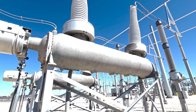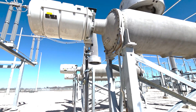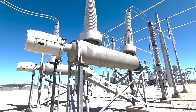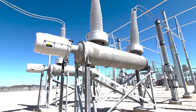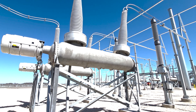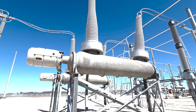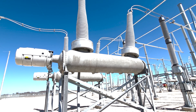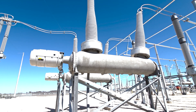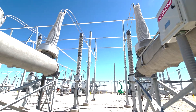One small difference is the pressure. You didn't need as much pressure in the SF6 breakers, but these have about 125 pounds of pressure inside, so they actually needed to bring quite a few bottles out. If it was SF6 you'd need maybe one and a half bottles; these took many many bottles to fill up and pressurize. So it's already pressurized inside to 125 pounds. How are they able to puff that gas into the arc? Well there's another smaller pressure vessel inside that has even higher pressure — enough to puff that arc out. Once that happens, a compressor of some sort repressurizes that internal smaller pressure vessel to get it ready to puff on the next operation.